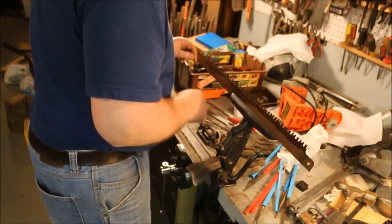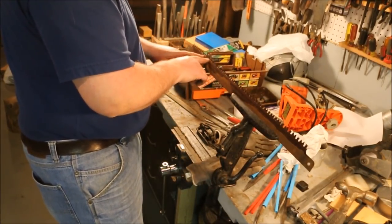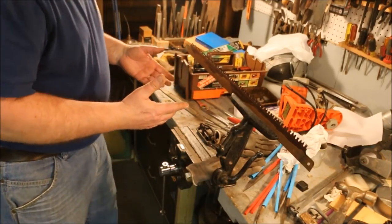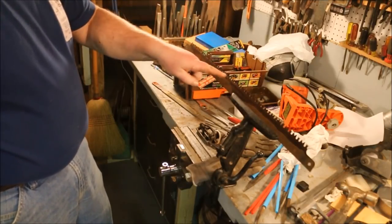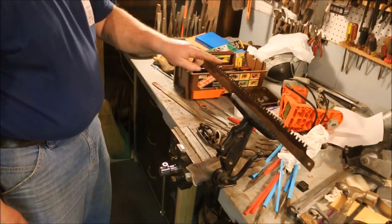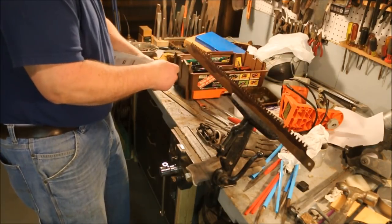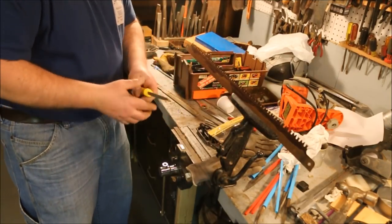Now this blade also has a tooth broken off back here. We could sharpen this down to the point where that tooth is the same height as all the rest of them. But all you're going to do is wear away a whole lot of tooth out here on teeth that aren't really that bad compared to the one that's broken. And you're just going to waste a lot of metal. Now that we have it jointed,